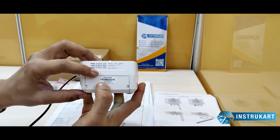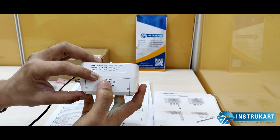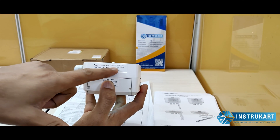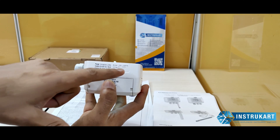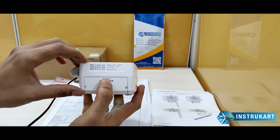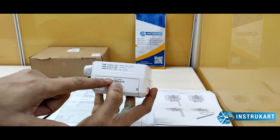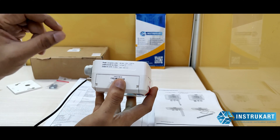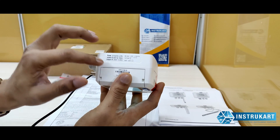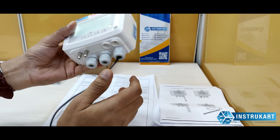As you can see, this model number is CP212. It starts with CP21, which is the series prefix. The '2' represents the maximum range of minus one thousand to plus one thousand Pascal. 'B' represents the power supply, which is 24 volts DC. The 'O' represents the display — if it is without display it would show 'N' — and 'R' is the relay output.